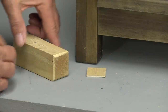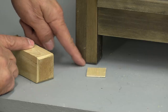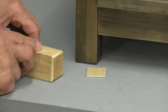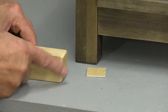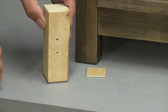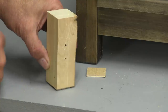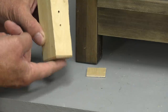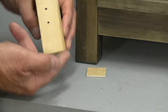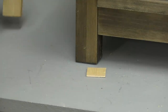Here's a little feature you'll find on the bottoms of most legs — or you should find — and you can make it if it doesn't have one. You'll notice there's a little gap underneath. This is called a chamfer. The reason it's put on the bottom of legs is that if the table is pushed around on a floor, without the chamfer the bottoms of the legs will fray. So that's why we put it on there, and it looks good too.